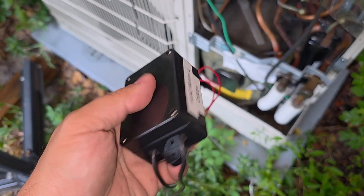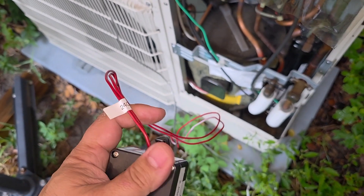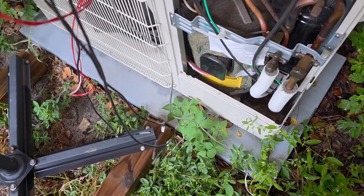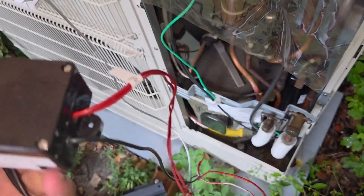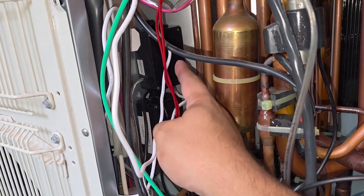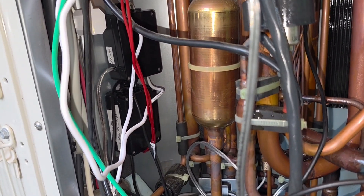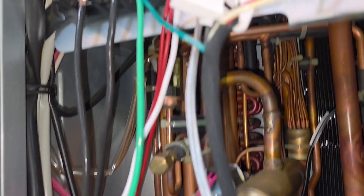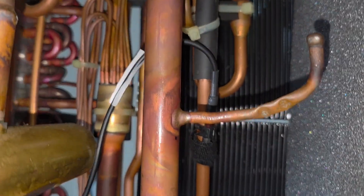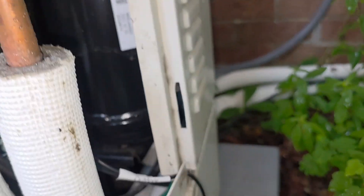And here are your temperature sensors for your outdoor unit. We're going to power it with 240 volts, and we're also going to have a suction and a liquid line temperature sensor. The third temperature sensor is going to be our outdoor temperature. The modules are way back here now, affixed using some magnets. The power module is going to go right here and read the power being sent to the indoor unit as well as the power being sent to the compressor over there. We've got three temperature sensors: a suction line, a liquid line that's way back there, and an outdoor sensor.